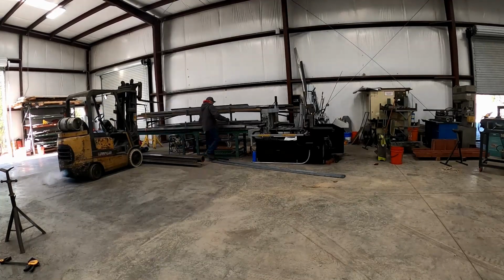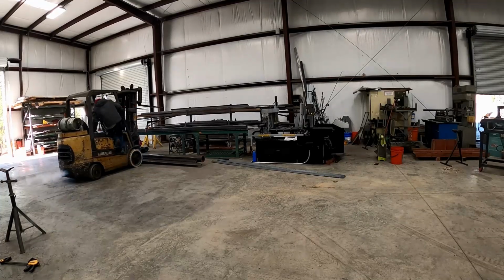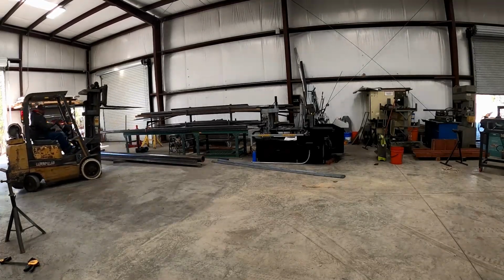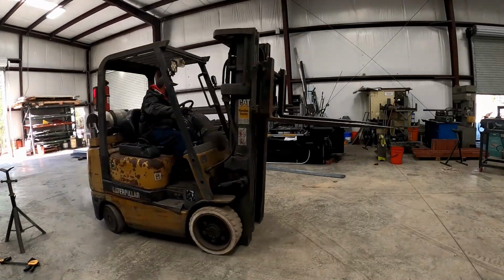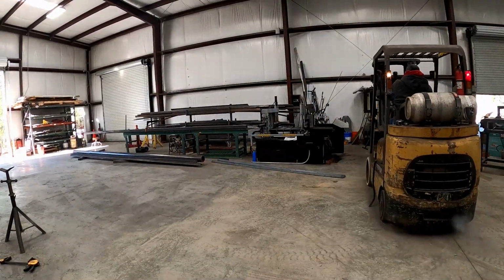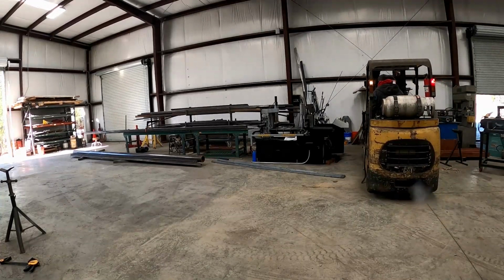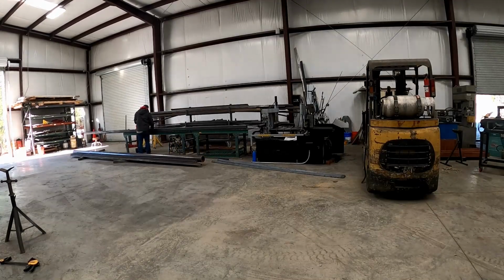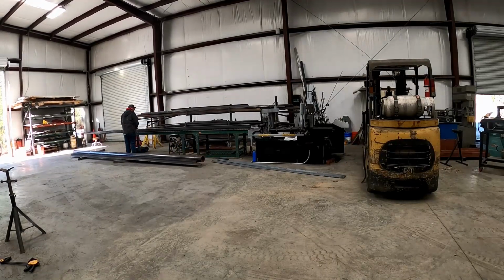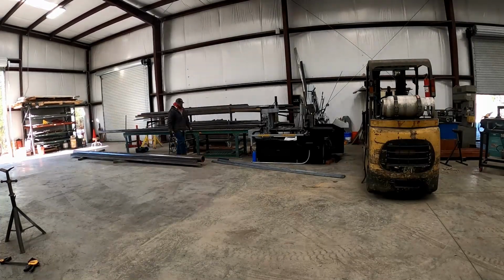And here we go, loading on the saw to start getting our initial cuts made. Getting the forklift ready to hold them, because I believe they are 100 inches long, and cut at 22.5 degrees so that the front portion of the skis will make a 45, so they ought to slide nicely through the bottom of the trench when the slider box is posted down in the hole.